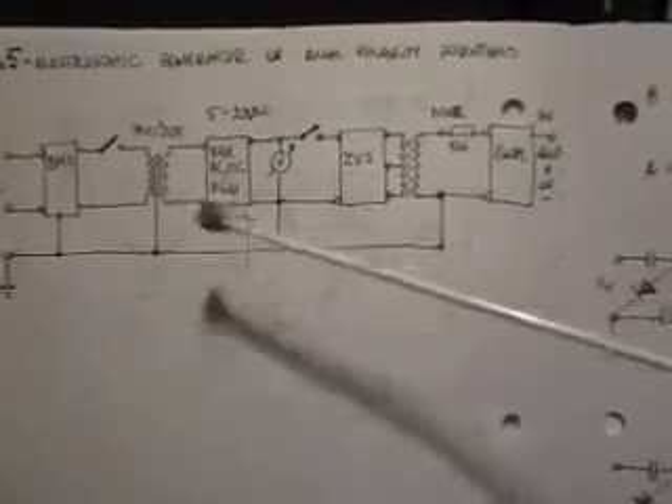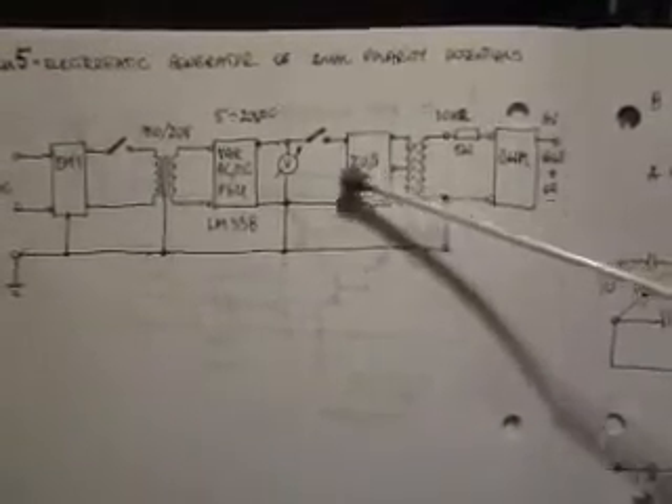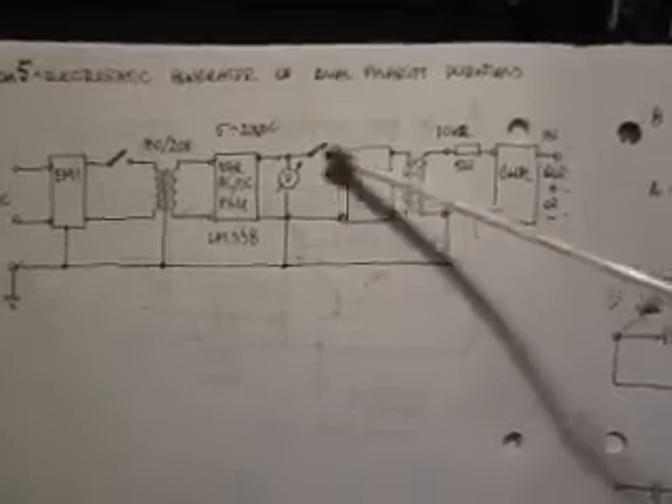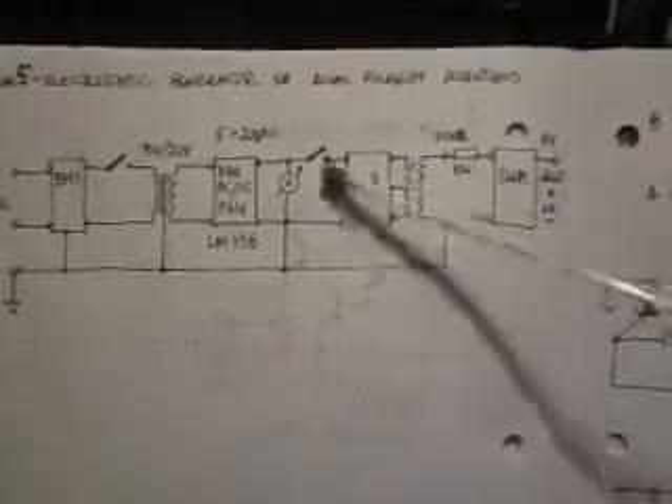The second switch is a safety feature so there's no way you can turn one switch and have a high voltage output by surprise. The second reason is that the ZVS responds to fluctuations once it gets power. When you turn the main switch, the capacitors in the PSU charge and there's a little fluctuation, especially at low voltage ranges, so ZVS might not work properly. Normally ZVS is designed to work from about 12 volts up, but I managed to get it working from 5 volts.